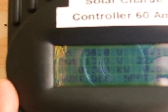I don't have full sunshine — there are some clouds in the sky — but I'm getting 55-56 volts coming in at 6.2 amps, and as you can see that's charging my batteries at 13.8 volts and 22 amps. So that's pretty good for those Harbor Freight solar panels.